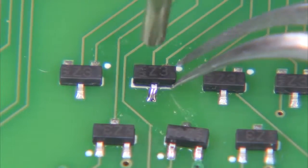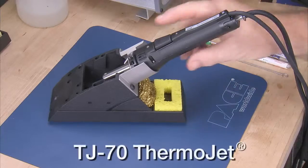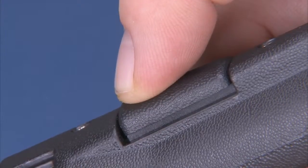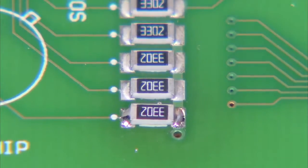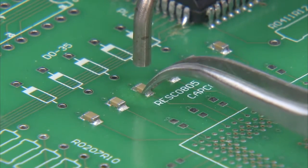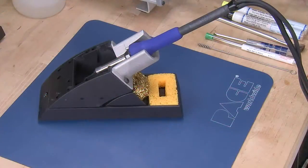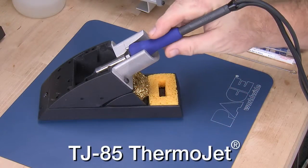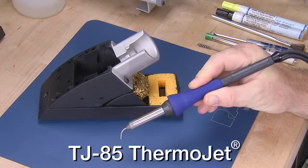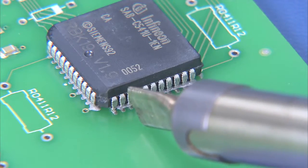The MBT350's high-resolution pressure control using the TJ70 ThermoJet handpiece offers focused single-point hot air reflow for a wide variety of surface mount installation and removal applications. For more delicate applications, the slimline TJ85 ThermoJet handpiece provides precise control and access in the tightest places.